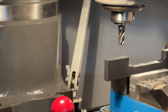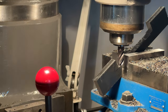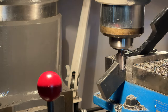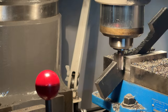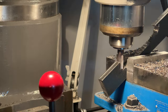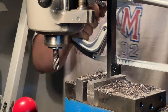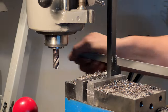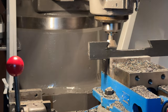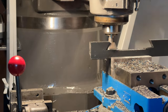The cross slide wiper cover was originally a piece of cast iron that was shaped to cover up a felt wiper. The felt wiper keeps the ways clear of any dust or debris, and with a little oil, will keep the ways in good shape indefinitely. The original piece was cracked into 3 pieces, and I only had 2 of those. Thankfully, I was able to use those 2 pieces to get some key measurements.